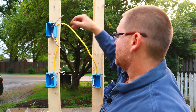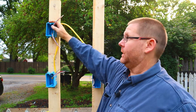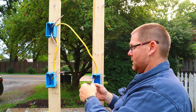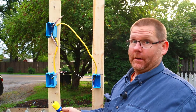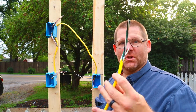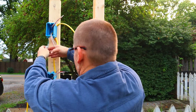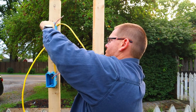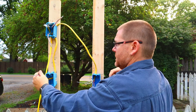In your light box, where you're going to carry your power — Kimberly, when she emailed me, her switches had only this and everything else was up in the ceiling box. She was confused about why the white wire was not a neutral. When we run our hot wire — let's say this is the hot wire from the panel — this would be coming from the panel. Obviously if this was Romex, I would write on it 'hot' or what have you.